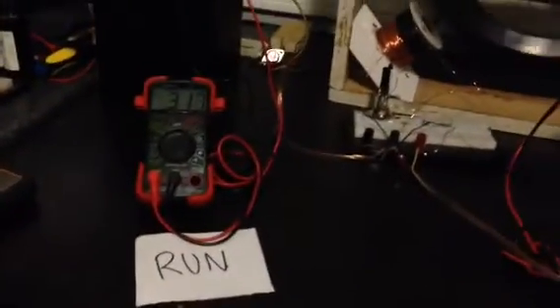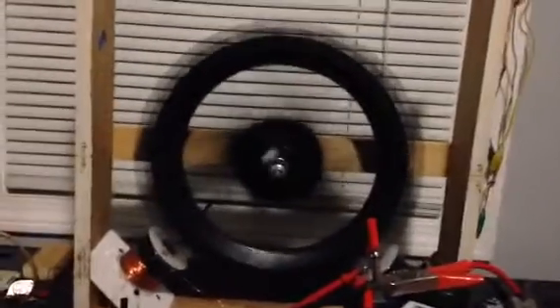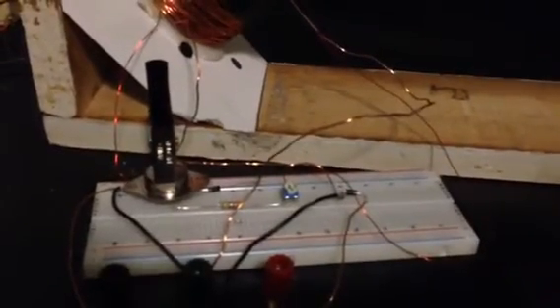That is my setup. We've got the run battery, a plastic five-spoke wheel — so there were three sets of magnets for each spoke section, making it as even as I could. My circuit: the wires from the coil run directly into this breadboard. I've used the absolute minimum amount of wire I could to set this up. That clamp is holding the wire from the coil and the one from over here.